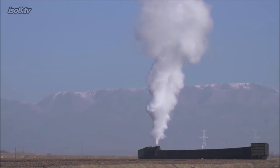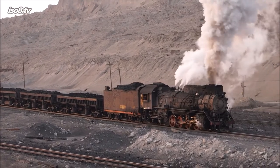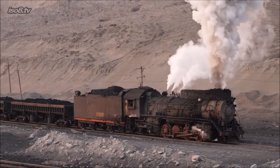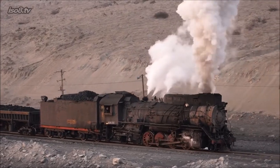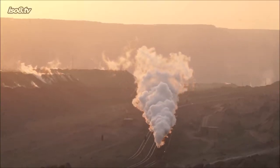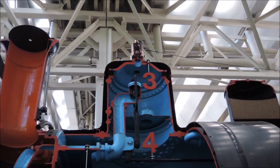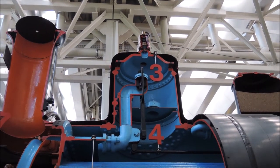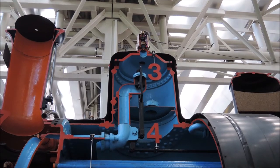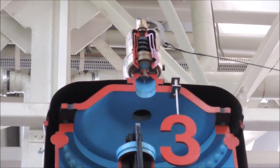And while it unquestionably is something to be appreciated that coal mining and generally the use of coal are declining now as their environmental impact becomes intolerable, the steam locomotives operating in the extremely cold moonscape of northern China certainly are a sight to be missed. Having produced our steam at a sufficient pressure — typically 12 to 16 bar or 174 to 232 psi — we have to collect it from the boiler.